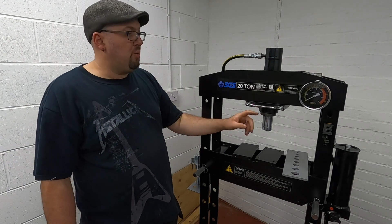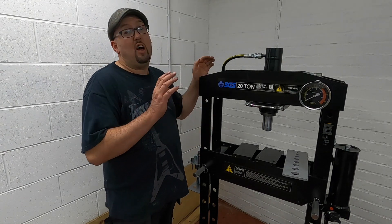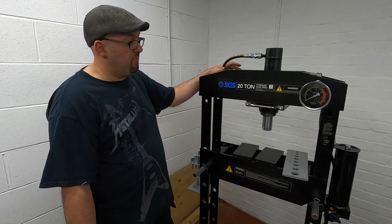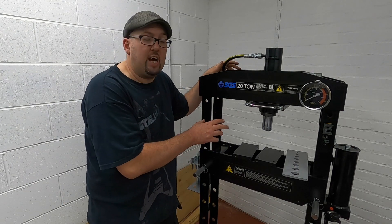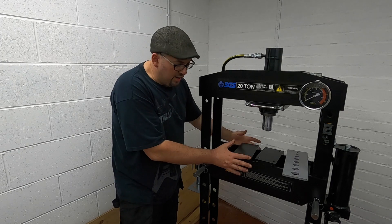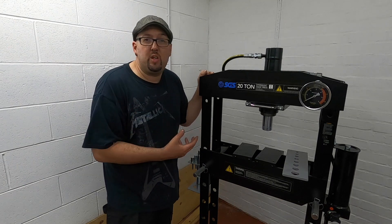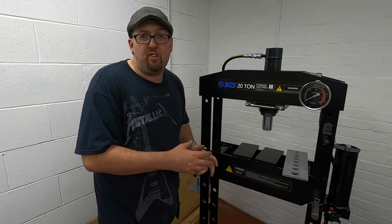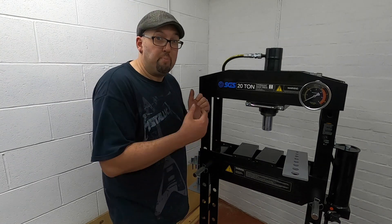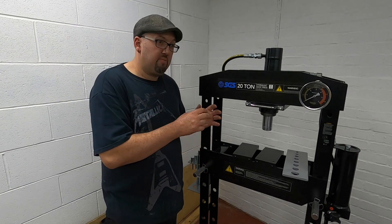It's made of a good range of decent thickness material — 8 mil, 10 mil, half inch, 20 mil. Good quality. I've got nothing to do with the firm whatsoever — I bought this completely off the reviews on the website. I'd been hunting around for a while and couldn't find what I wanted. I knew I wanted a proper ram, not a bottle jack. I feel you get more precision with this than a bottle jack, because the bottom of a bottle jack always wobbles. I think this is going to be a great addition to the workshop. I've bought it to get to the next stage on the steam engine build, and I can see it being used in all sorts of projects.